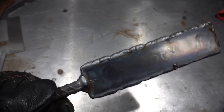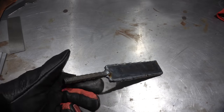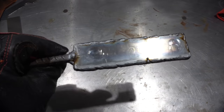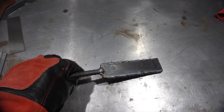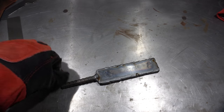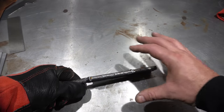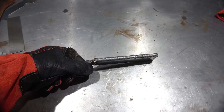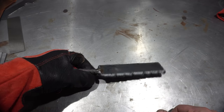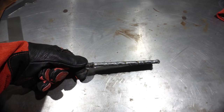Here's the billet after welding — you can see I've welded the edges all the way around. I like to put a little piece on it because I hold it with tongs. As long as it's all sealed up that gives you insurance so the copper won't come out. We're going to put this in the forge and heat it up. Keep an eye on it and don't let it get too hot, especially if you have a hot spot in your forge. Heat it up to a red color, then use the flat dies and apply some constant pressure as if you were forge welding, after getting it up to around 1,800 degrees. A couple of heats with flat dies and pressure, then we'll start to draw it out.